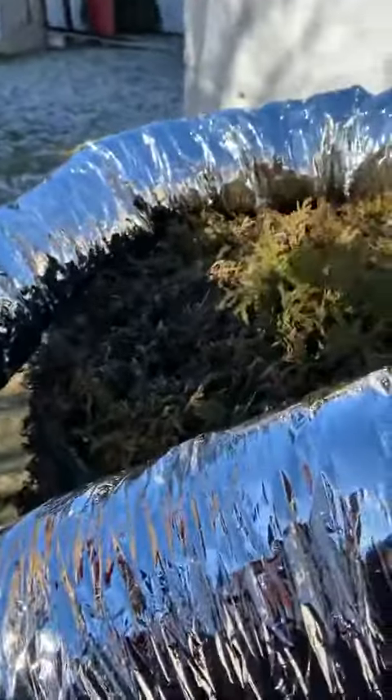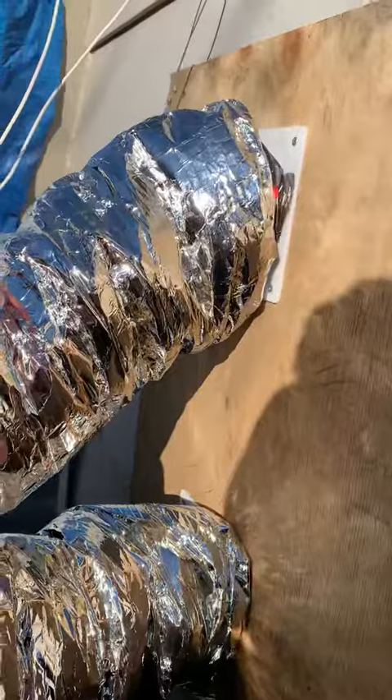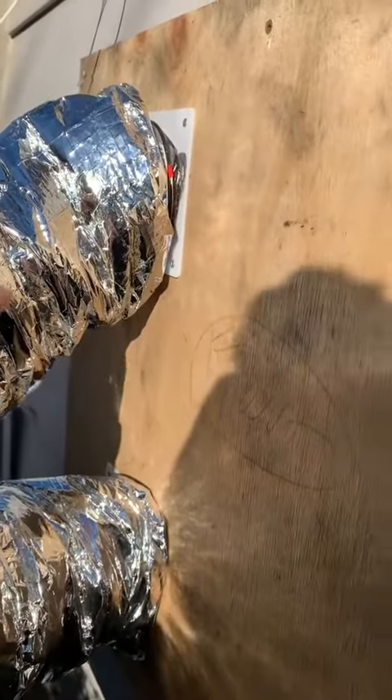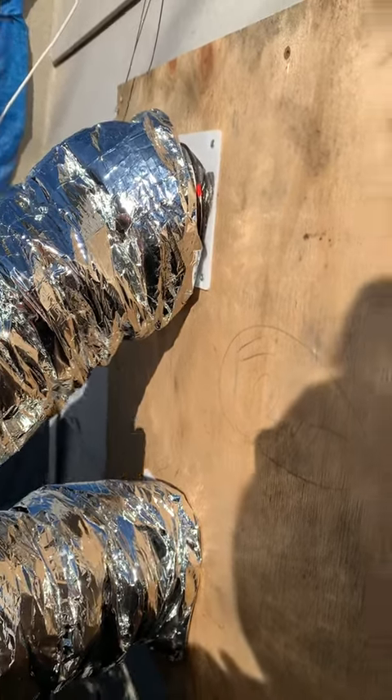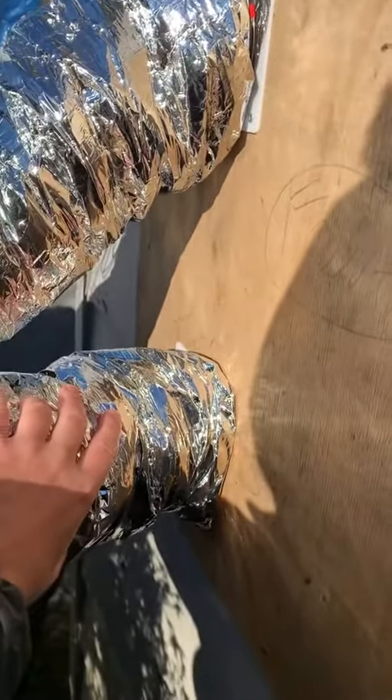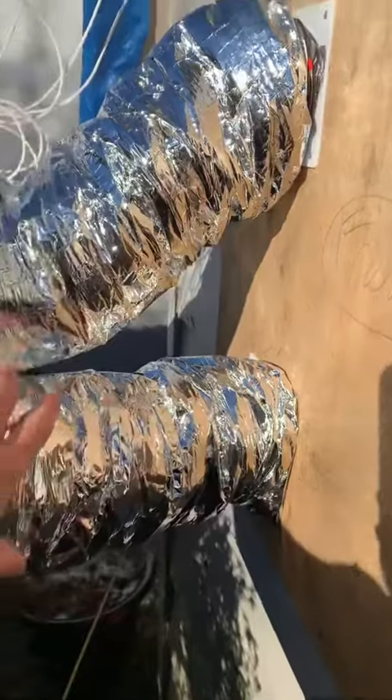Before going into the shed — this is the outlet duct from the unit. The fan pushes the air through the outlet duct into the top of this insert in the window. The hot air has a lower density so it rises, and this is the return duct down here. The colder air flows back into the unit at the bottom where it flows back up to the fan to get pushed in.